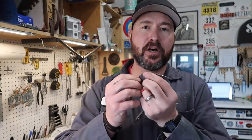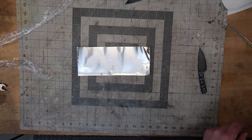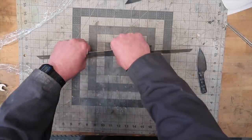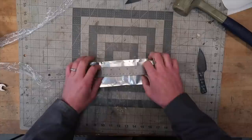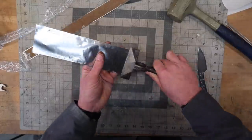Now we've got these two ready to go, we're going to make some stainless steel envelopes using 309 tool wrap. The temperatures we're going to are very high — 1950°F — and at those temperatures if we just put the blade into the kiln, the oxygen would start burning the carbon out of the steel, decarburizing it. So we'll make a small envelope, fold the corners over, and hammer it tight so it's airtight. I also put a little bit of baby powder on the blades to protect them from possibly welding themselves to the foil during the plate quench.